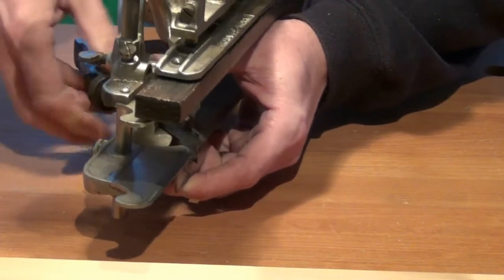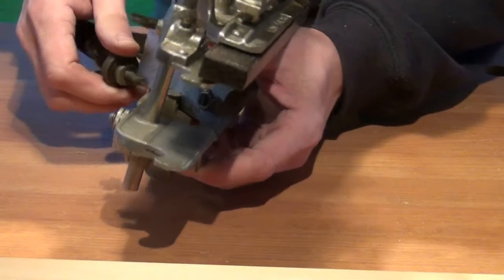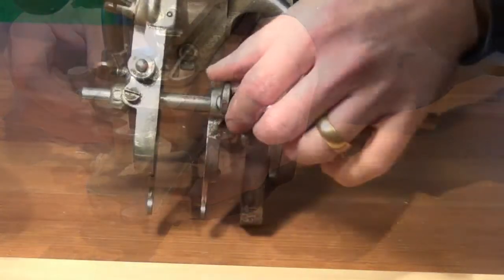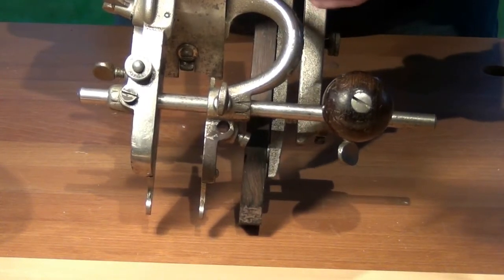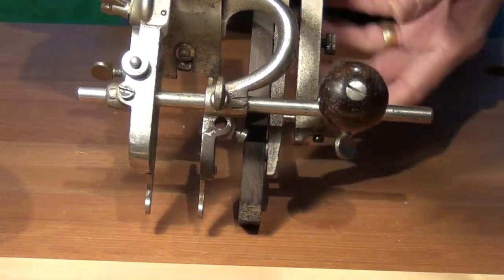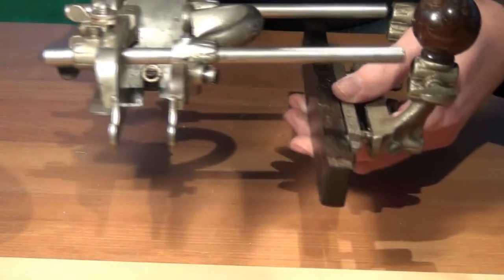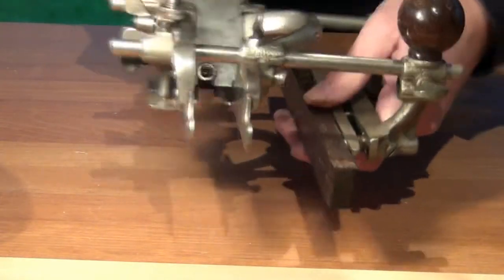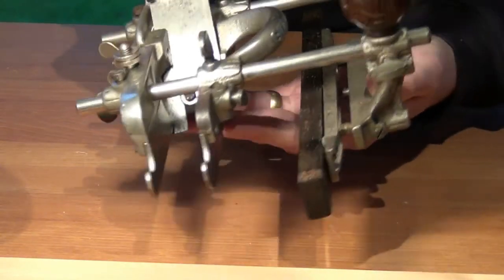This is quite a wide cut so we don't want to take too much material at one go. I'm positioning the sliding section as far over as I can without impeding on the curved section of the cutter. The fence will need to be set in its top holes so that it can ride below the cutter if necessary, depending on the width of your stock.